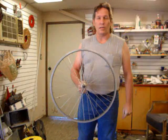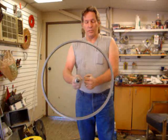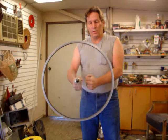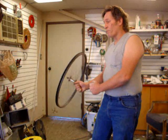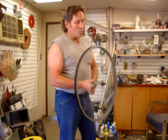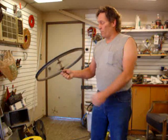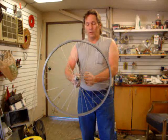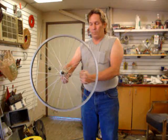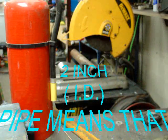Which side is correct to put the pole or yaw bearing? The wind pushes on this and it turns to furl out of the wind — the bottom goes up. If I go the other way, the bottom wants to go down, forcing the blades into the pole. That's the theory of gyroscopic precession: go to the right, it wants to go up, which means the pole is on this side. The wind pushing here with the pivot here would make it turn correctly — so this is the side you want your pole to be on.